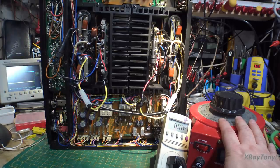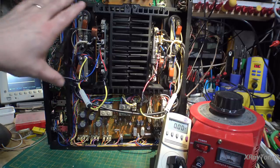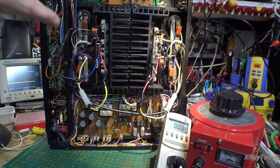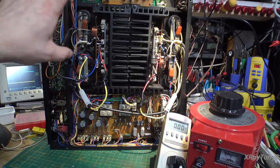Now, I've disconnected the main power rails from the amplifier, and I've tacked in these inline fuses, and literally there is only a 1/2 amp fuse in there. So really, if you put a maximum of 70 volts in there, let's say, and I don't think there's that much going in there, but let's say there's 70 volts at 1/2 amp, that's only 35 watts. And remember, we have three parallel transistors that are capable of handling over 100 watts each. So there's 300 watts on each complementary side. So I'm way under what those transistors will take before they'll short out and burn up.